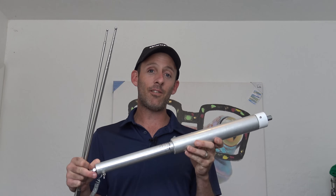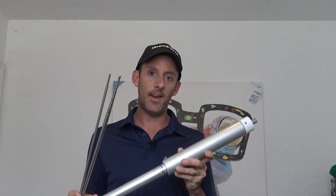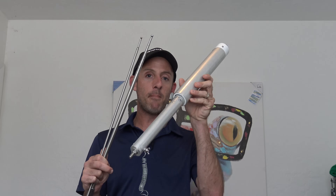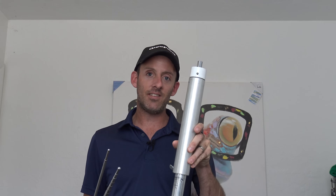This goes 6 through 80 meters. Let me explain exactly what's happening with this antenna so you can understand — this is called a manual screwdriver antenna, and even with something like this, you do not need a tuner. This will be a resonant antenna.